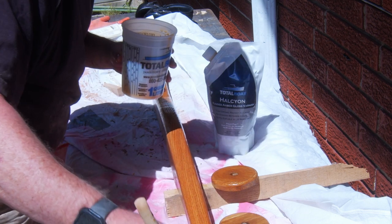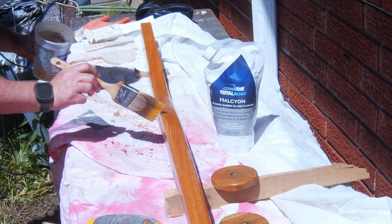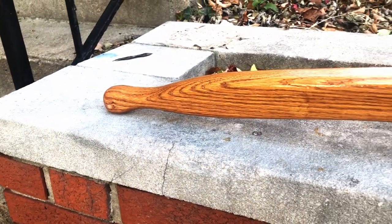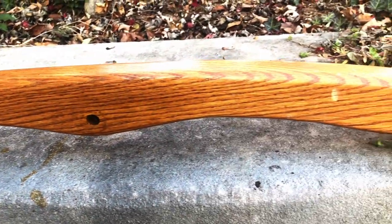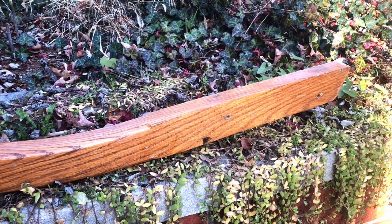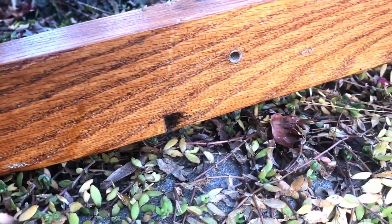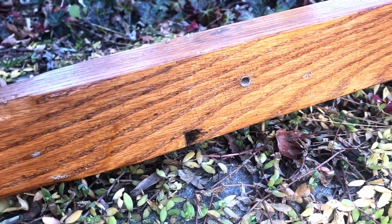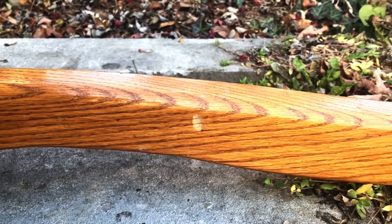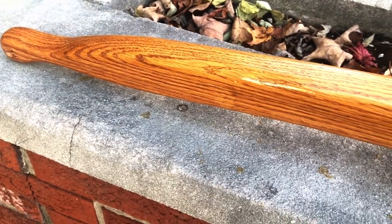One of the reasons I held off on showing you how this was made is that I wanted to show you how it stood up against wear and weather, which includes rain and UV exposure. So at the end of a season with a heck of a lot of use, I took it off and examined it and I'm really pleased with it — there's just a couple of little areas I'm going to have to touch up in the spring. Back where the tiller fits into the rudder bracket, there's a small area where the stainless steel dug into the tiller a little bit. And up here there's a place where, when I had to throw the rudder over kind of hard sometimes, it would run into a small piece of untreated fiberglass which scuffed it up — I can fix that and also fix the area that caused the problem in the first place.